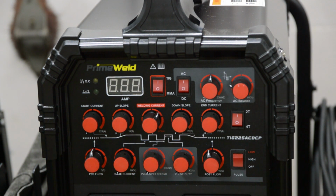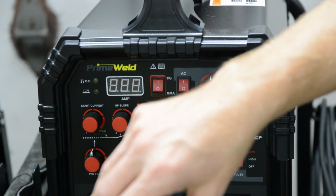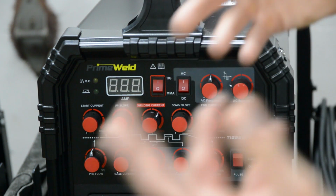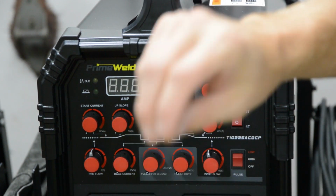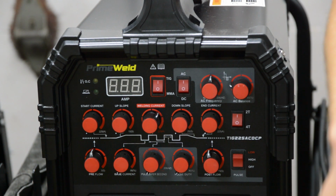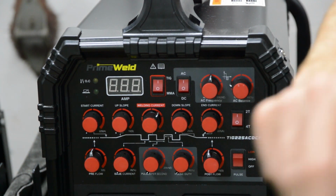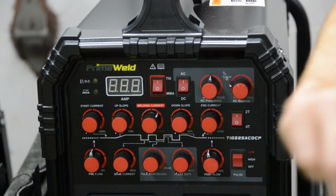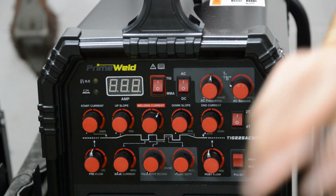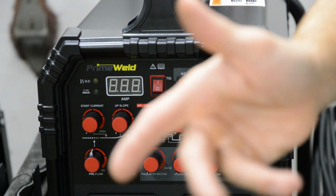And one thing I want to mention about the weld on the timing cover is I had a lot of contamination. As I started to weld, I saw all this black junk come out of the metal of the timing cover. That's because that timing cover was on the engine since 2005, so 15 plus years, and it was in contact with oil. So I think there was oil inside the metal. And I did my best. I baked it on my grill at 350 degrees for an hour, and I vapor blasted it, degreased it with acetone and whatnot, and I still had that junk come out.